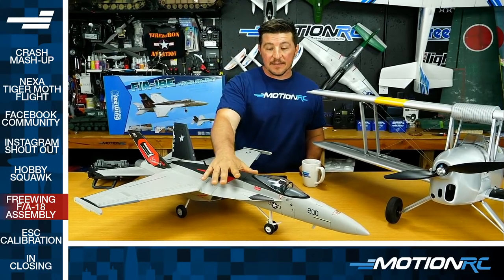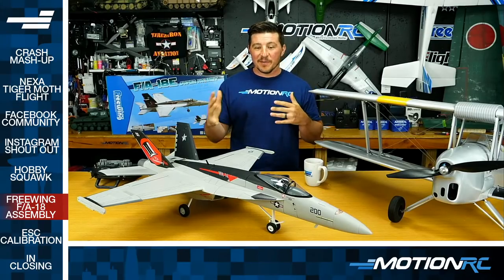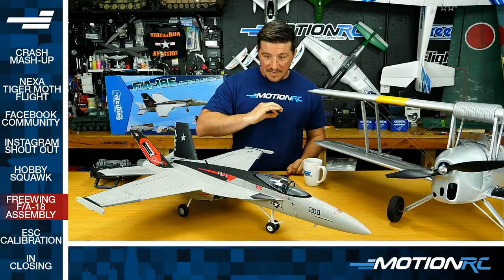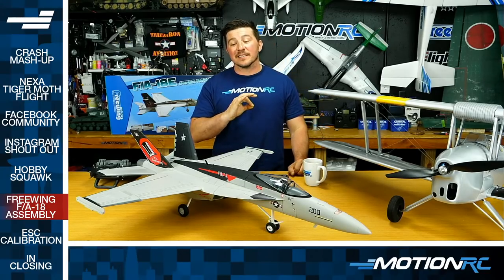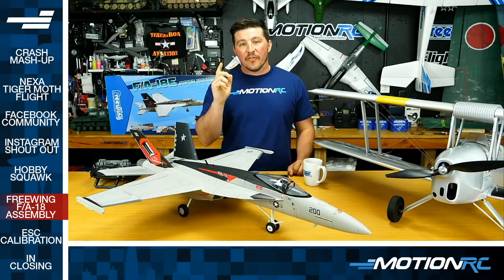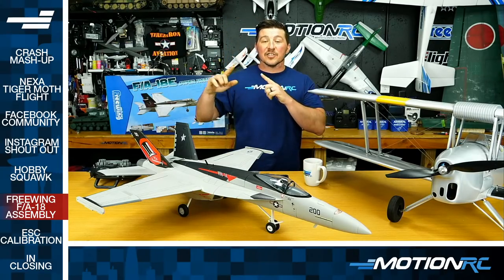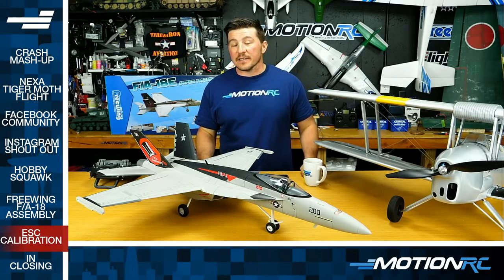When I plug this in, I noticed right off the bat, and it was great because it's a learning moment to show people, that when I initially set up and started to move my throttle stick, it went up almost 20% before the motor kicked on. So that is what leads us to the next and last step, ESC calibration.